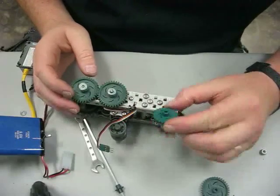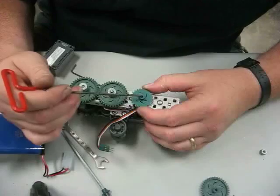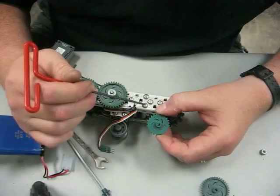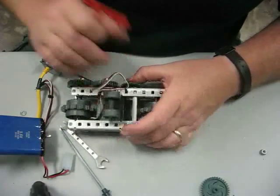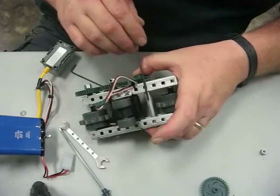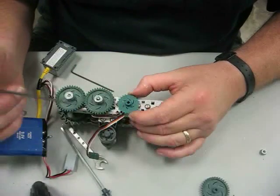What I have to do is take one of these larger gears — I can't use one of the small gears like I originally wanted. I have to drill the center of this out so the shaft will spin freely, and then attach this sprocket to the frame. I'm going to use the two screws that hold the standoff on, and put a spacer between the frame and the gear. I'll attach the screw through the sprocket, through the spacer, and to the standoff that holds the track assembly together. That will attach this sprocket firmly to the frame and allow the shaft to spin freely.